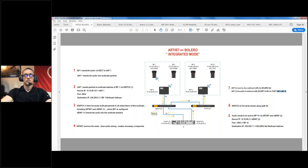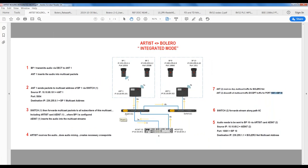the antenna and the belt pack are using a process called frequency and time division multiple access. Now, what the heck is that? Basically, all of the belt packs can share a common frequency or a common carrier and simply occupy that carrier at different moments in time. So it's almost like a shutter on a camera where you're taking very, very quick, short snapshots of information. So belt pack one might be using frequency number two, and it's using it every other period. Belt pack number two is using that same carrier just on opposing periods that belt pack one is not using. So almost snapshots of audio.